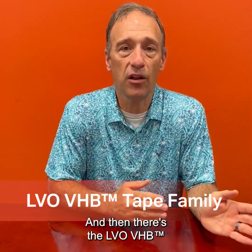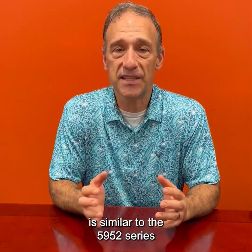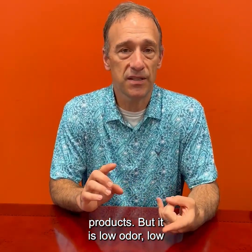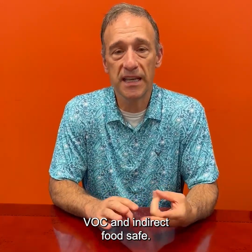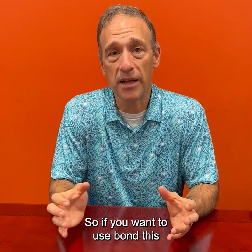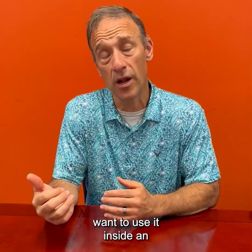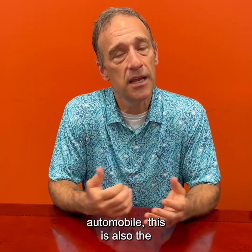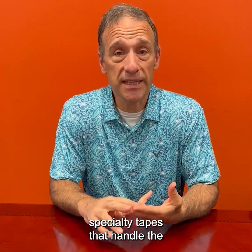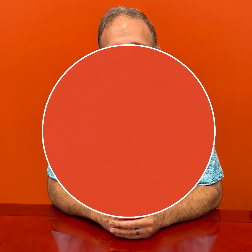And then there's the LVO VHB family, which is very new, and that is similar to the 5952 series products, but it is low odor, low VOC, and indirect food safe. So if you want to bond this inside a refrigerator, this is the product for you. If you want to use it inside an automobile, this is also the product for you. So three great specialty tapes that handle the rest of the 10% of applications.